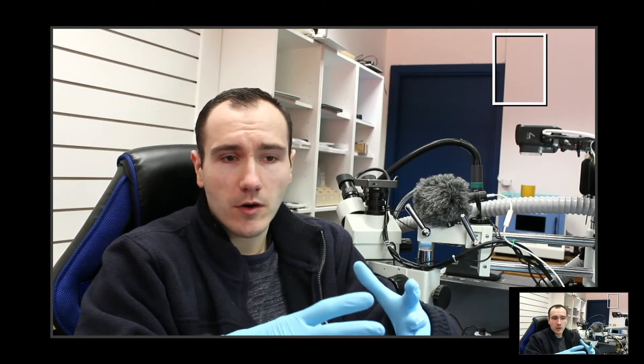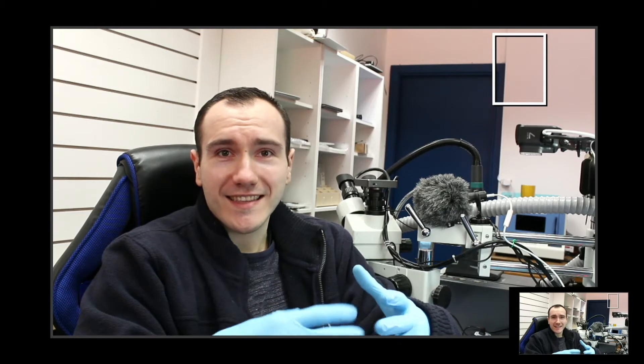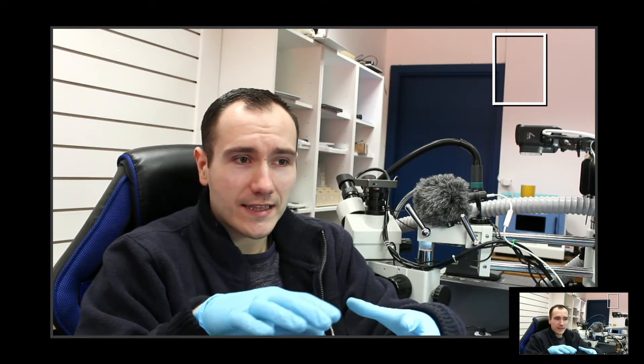The reason I'm making this video is to teach people where mistakes happen. That's normal — everybody makes a mistake, and it's good if you can understand where you did it and fix it yourself. Otherwise your phone will end up here or at some other shop fixing your mistake for you. Basically when you're doing the connector installation in the phone, connecting a new screen, you have to be gentle — the connector has to click delicately. If you miss-click that connector you can jam it and break one of the resistors around there, giving you no image. The damage could be worse — you might short something, see a spark, and the damage will be bigger. You can avoid all of this just by being a little more careful, and of course after you do it once you'll probably never do it again. Hope this helps somebody — I'll see you in the next one.